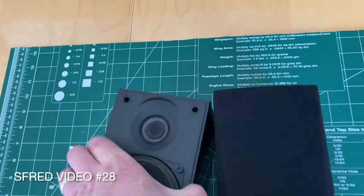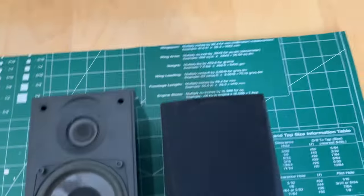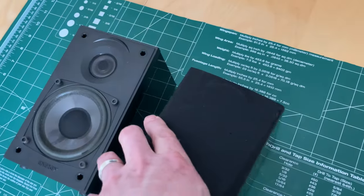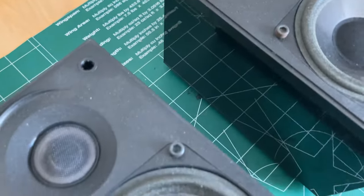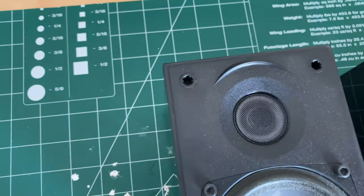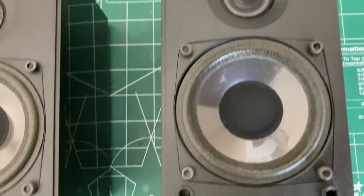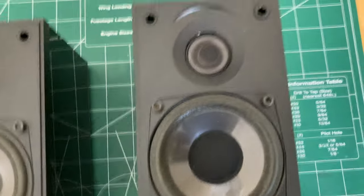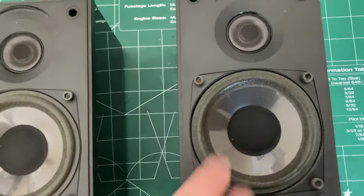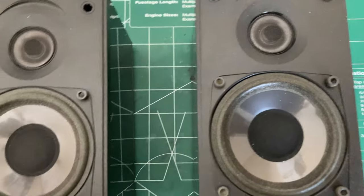What's interesting is that the glue has failed, or someone's opened them to mod them, on both of them. But in both of them the cones seem fine. They're three inch woofers and some sort of small tweeter. This looks like metallized polypropylene, which was supposed to be fancier than regular polypropylene. It's very much characteristic of the era, but they seem fine.